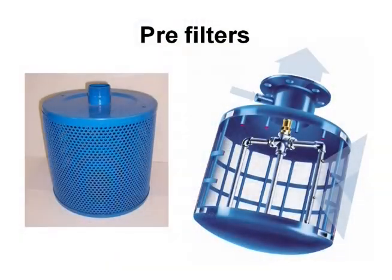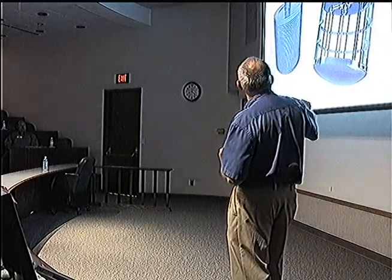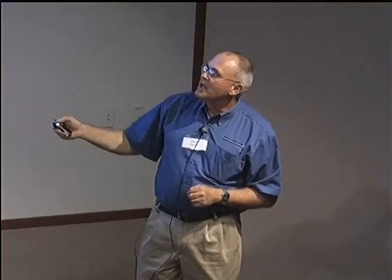The first line of defense is to have pre-filters. We're talking about surface water here — either stream or pond. You can see the one on the left; it has large perforations to keep fish out and let the water in, though it's not going to stop the fine stuff. This other device actually spins using pressure from the pump — it's pumped back out to the intake, the nozzles spray against the screen, keeping things from getting packed against it as water is sucked toward the intake. Nine times out of ten, a basic screen is going to be satisfactory, unless you're pulling way too much water through it.